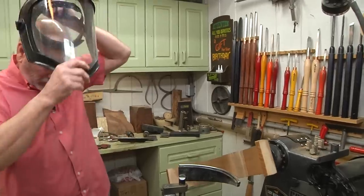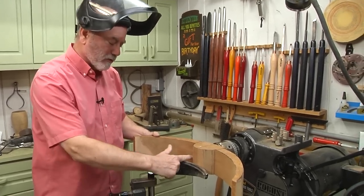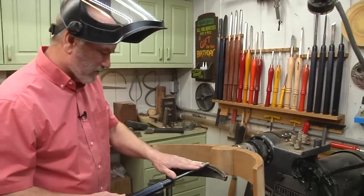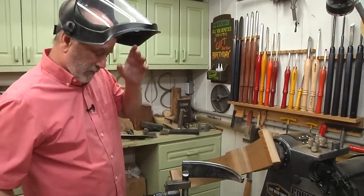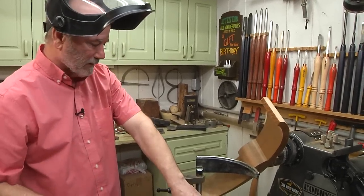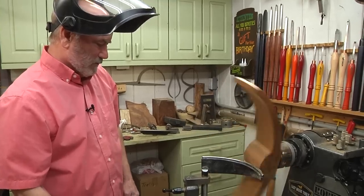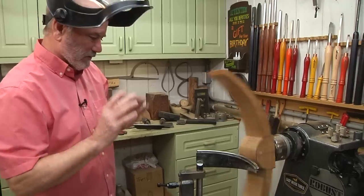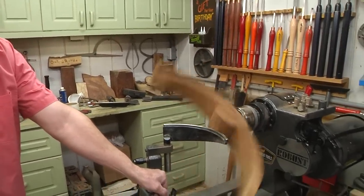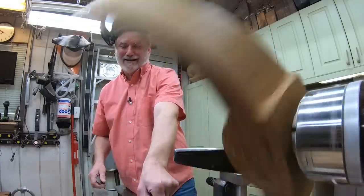The tools you can use — you could use Easy Wood's carbide scrapers in here, but I'm going to be reaching out a little far for those. So I want to use a bowl gouge simply because I have a much smaller line of attack. We want to start this at a really slow speed, and that's what's great about the American Beauty Lathe — you can start at about 20 revolutions. I'm going to turn this up; I don't want to go real fast, but I do need enough speed that I can cut. And this is kind of scary.